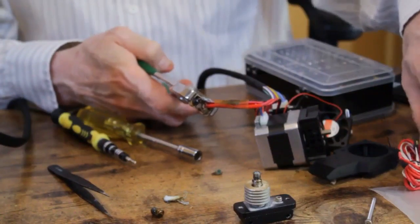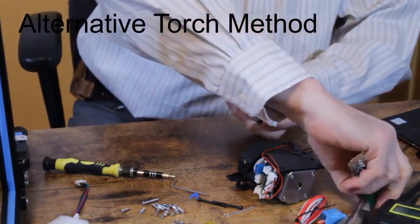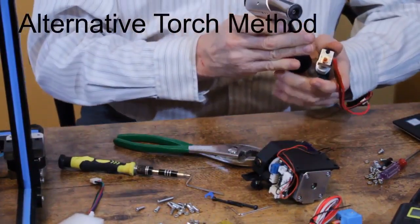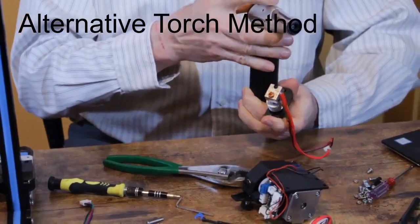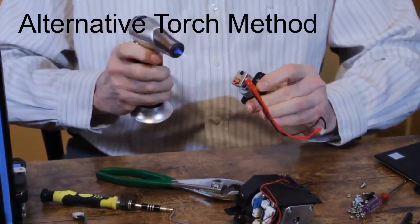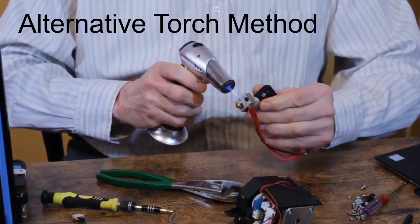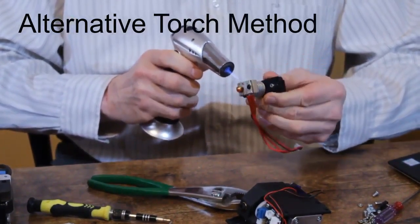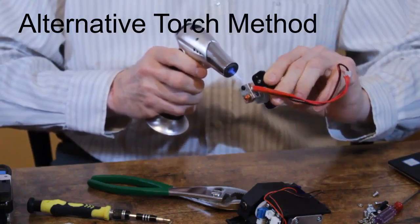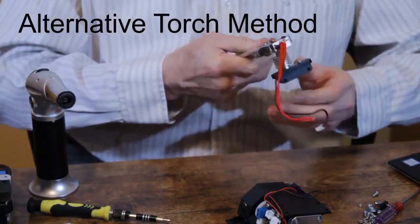I'll show you in a little bit how to do this whole thing using a torch. We're gonna need this nozzle and heat block, and since I was unable to remove it because of heating plastic, there's melted plastic inside, I'm going to heat it up with a torch. Now, as I mentioned earlier, if you do this before you take the machine apart, you can use the heating coil, but since I have a torch available, I find that the easier way to do it. So basically I'm just heating the heat block up like the heating cartridge would. And I'm holding the cold block, so I have plenty of thermal mass in between to keep my fingers from being burned. Now grab it with the pliers.